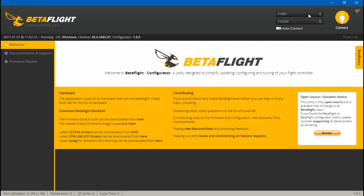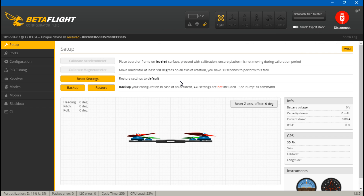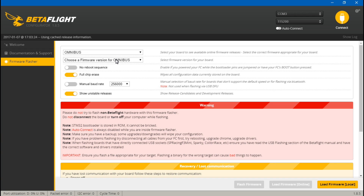After the driver changes, click Close. Now under Ports (COM & LPT) you'll see it listed as CP210X USB to UART Bridge on COM3 - it might give you a different COM number, and that's perfectly fine. Go into Betaflight, select COM3 from the dropdown, and click Connect. If you get an error message with no tabs on the side, your flight controller probably has Cleanflight firmware on it - you'll need to go to Firmware Flasher and flash new firmware. Check the description for a link to the Betaflight playlist for that video.